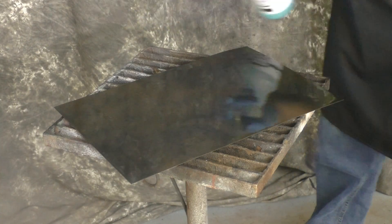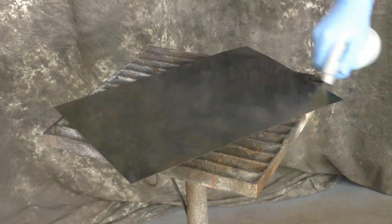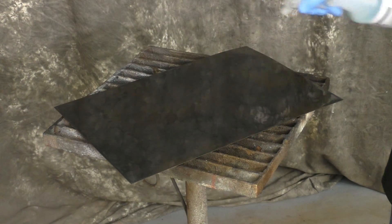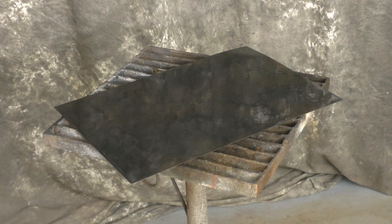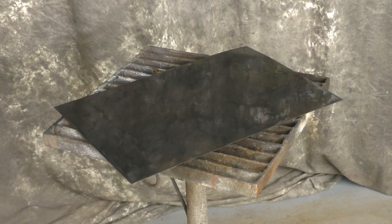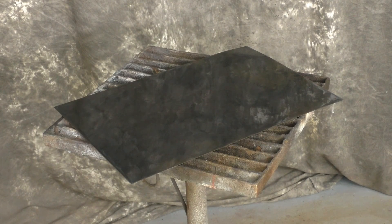As you can see, those first initial dots that got onto the zinc reacted first. That's very typical of a reactive or traditional patina — it's just kind of how it goes. You can try and roll it on or brush it on. The nice thing about the acidic patinas is they react however you get them onto the bare metal. That's why we're saturating it so much — as it sits, it's going to kind of auto-level out and we won't see those dots nearly as bad. We're going to let this sit for about four or five minutes, and then we're going to rinse it off.